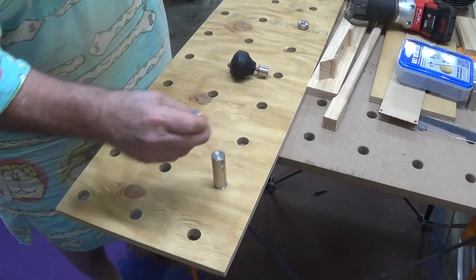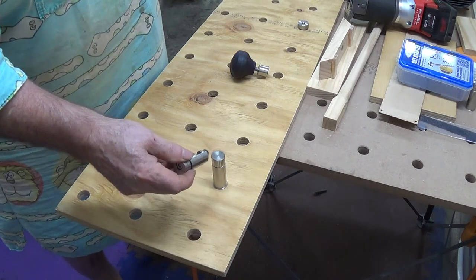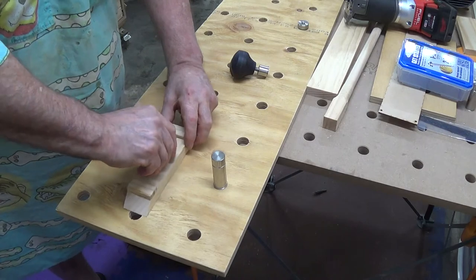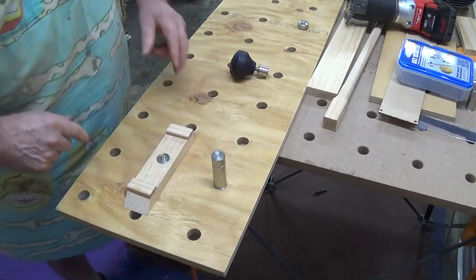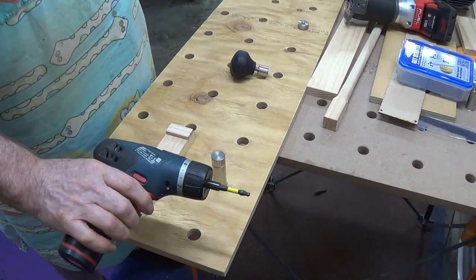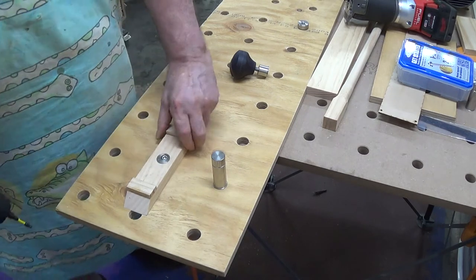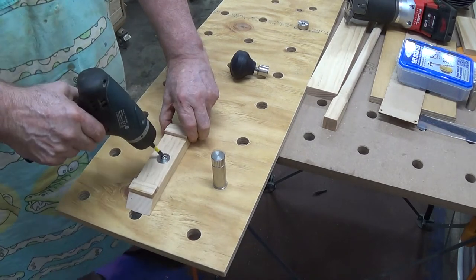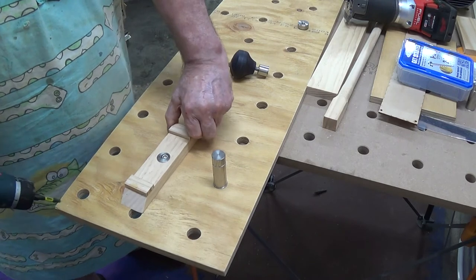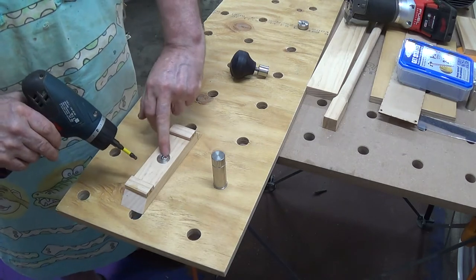They've got others, like these are now my favourites. These are those TSO lock dogs. Their main purpose, their primary purpose, is to lock two pieces together. Like so. And I use, this is a spare, totally redundant drill now. On its lowest torque setting, starts to ratchet and it's now locked. If I do it a little bit tighter, it's tight. The reason why it hasn't locked super tight is because I didn't go all the way down, because this hasn't got that chamfer on it.